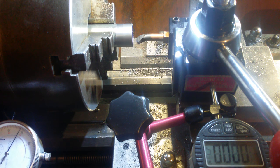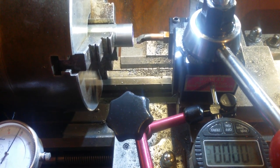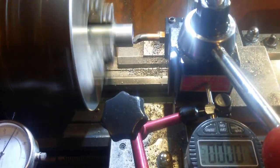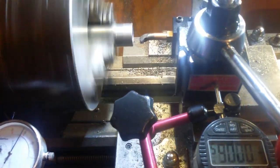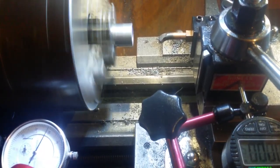And we are going to now see, it's not a very nice cutter. I took a shave and then I came out, yeah, that's what happened. So now I'm going to see if I'm set up for 24 TPI. Which I'm not, but we'll be in a second. That is 24 TPI. So let's give it a blast, see if that cuts 24 TPI. Run. Stopped a bit early. Push it away. And back out. Really wish I'd seen which mark I went on to. But not to worry. Stop.